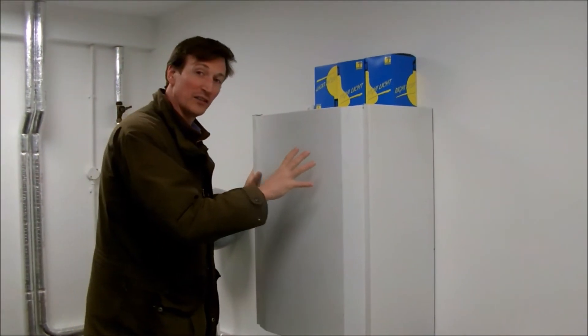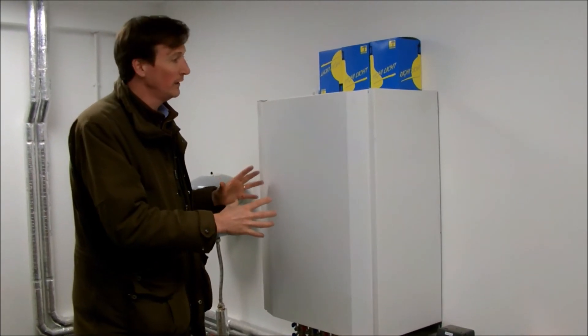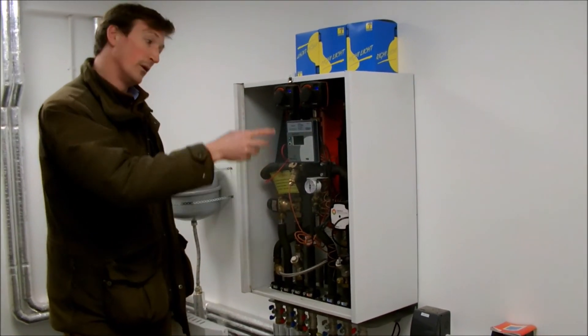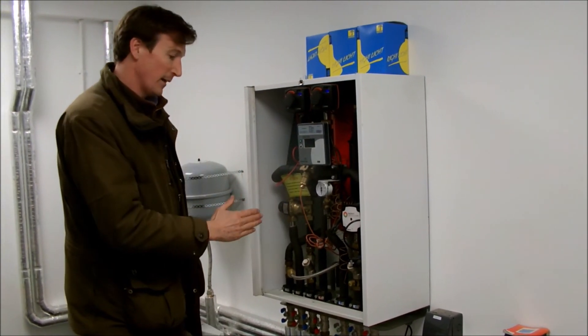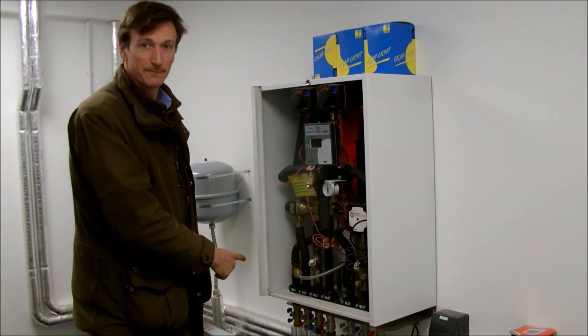This box here is replacing two former boilers that were fired on oil. It is just like a combi boiler — it has the heat coming in from the biomass boiler, which is then put through a couple of plate heat exchangers. It's called a heat interface unit. One mains feed heats the water and then a closed loop does the underfloor heating.